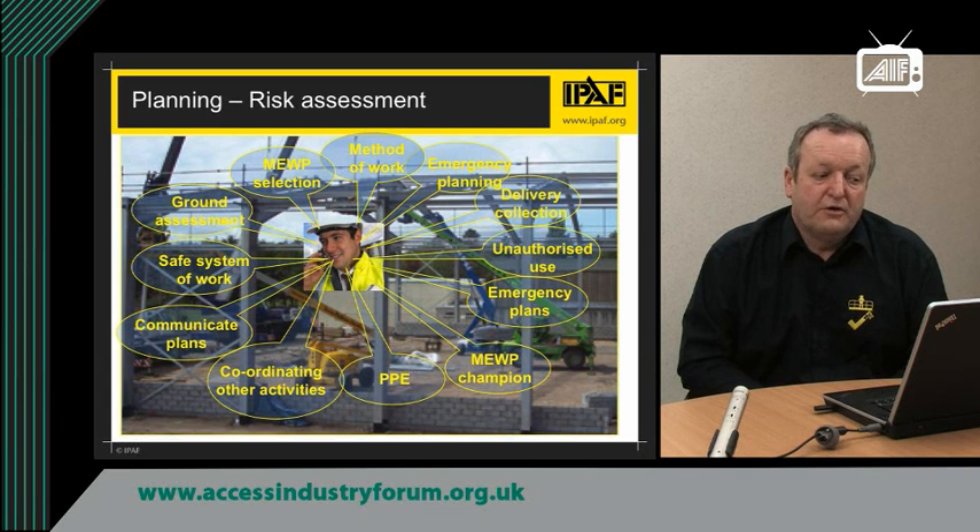A very important part of planning is making sure you have some kind of emergency rescue plan. So if there is an incident and someone does get trapped, there is a well-practised plan to help get that person down safely, quickly and efficiently to reduce the risk of serious injury. Another cause of entrapment is when people jump on machines and use them without authority, so make sure you have planning to prevent unauthorised use. Also consider where the machine is delivered or collected from, as travelling long distances through or around overhead objects will increase the risk of entrapment.